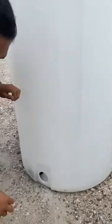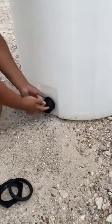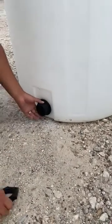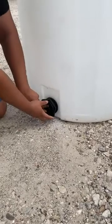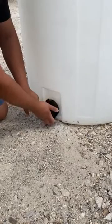All you do is reach in there, grab your bulkhead, and pull it on through. Grab your gasket, which is going to be the hard plastic piece — put that on first. Your nut is going to be reverse-thread, so you want to make sure you put it on correctly. You're going to do a lefty-tighty, going all the way to just the back.